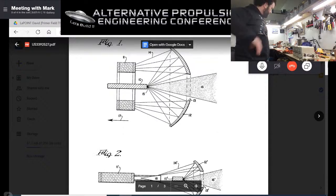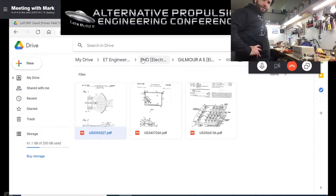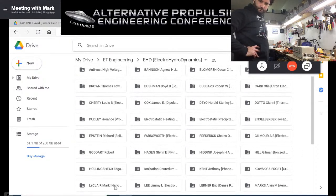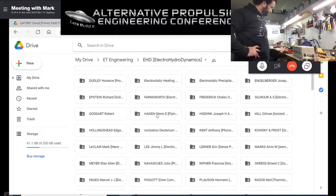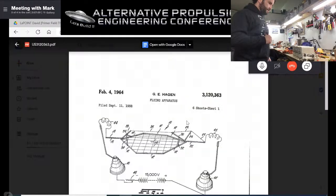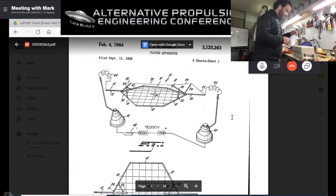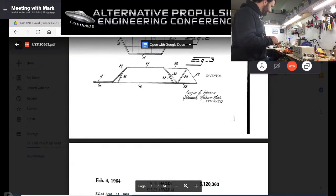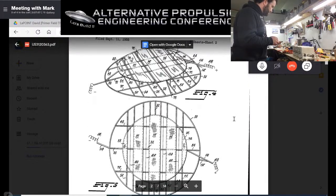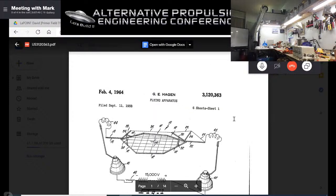Do you think it would be useful to stick a piece of iron in the center? In the center of what? Of the coil. Oh, you mean to just kind of amplify the field? Sure, you can do that. Isn't your disc going to be in there? Aren't you going to have it fully blocked by the disc? Well, right now I'm just doing the coil. Okay, if you're going to fire the coil dry, putting a piece of iron in there will give the energy someplace to go. It'll be less loud if you do that.